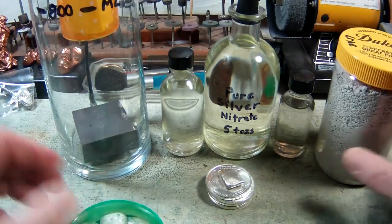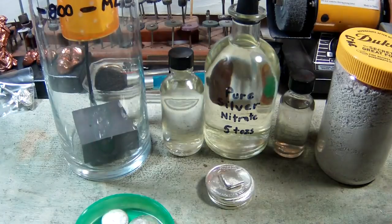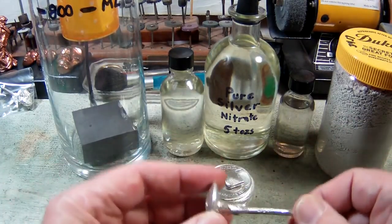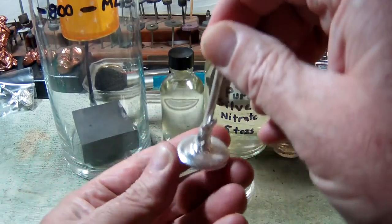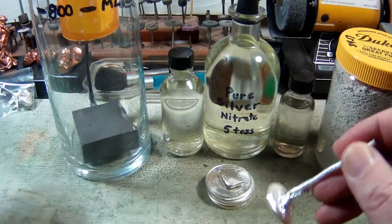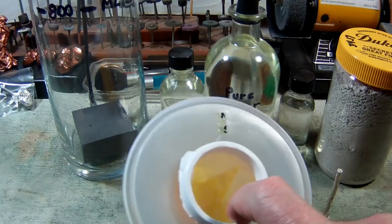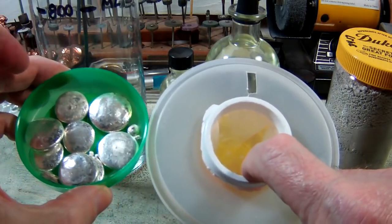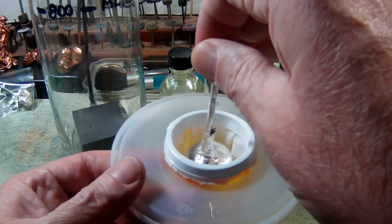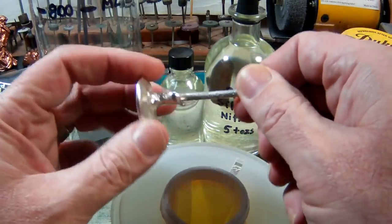I may do a mix of it. I've heard some people say it's better to do shot, some say it's better to do solids or bars. I had to make the anode, which is this little guy — just some silver poured around a rod. What's going to happen is we load this basket with whichever silver I choose, be it little buttons or shot, and then put this in the basket to hold it down and connect our positive wire to this.